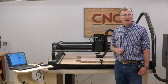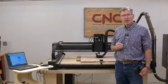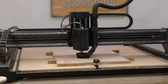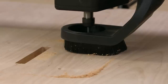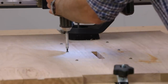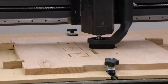This is one of the side panels for our Limbert table. We're going to approach this as a production piece — I want great quality but I want to get the job done. The first operation will be a mortise cut for the vertical stretcher. After that, the machine will drill six holes — one in the center of each of the primary cutouts — so I can secure the waste with a screw instead of using tabs. I'm okay with tabs on the exterior, they're easy to clean up, but within those tight interior spaces, no tabs. After the machine drills the holes, I'll secure them with screws and then initiate the profile cut.